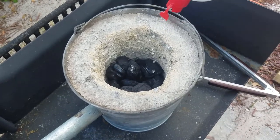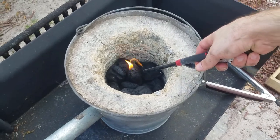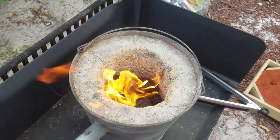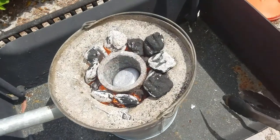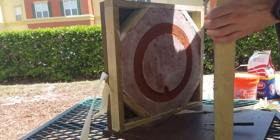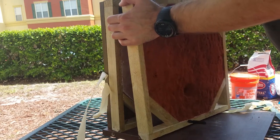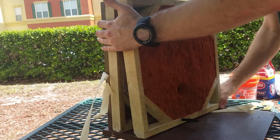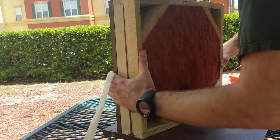To melt the aluminum, we're using a modification of the Grant Thompson King of Random style of foundry, using perlite, sand, and water glass instead of sand and plaster as the refractory material. This mix is lighter, doesn't crack as easily, and doesn't vent foul-smelling sulfur fumes after every use. After checking to make sure the inlet sprue is clear, and drilling several vents for the escaping gases, we're ready to reassemble the mold and do some casting.